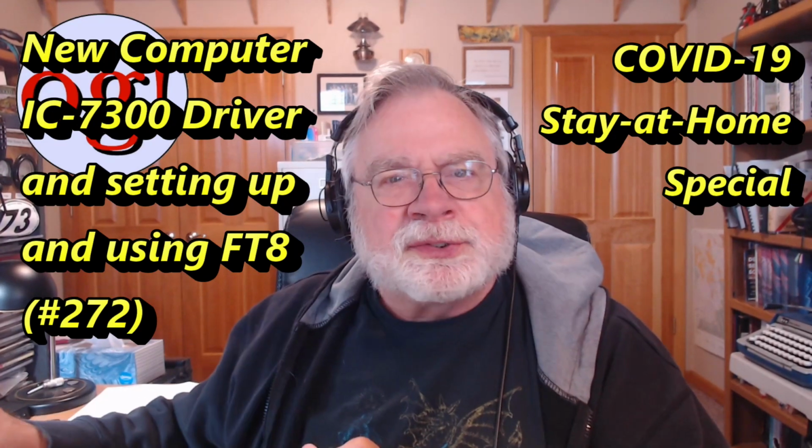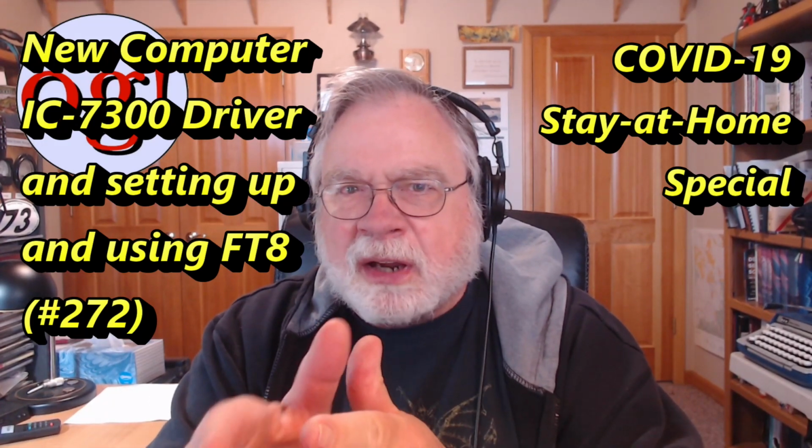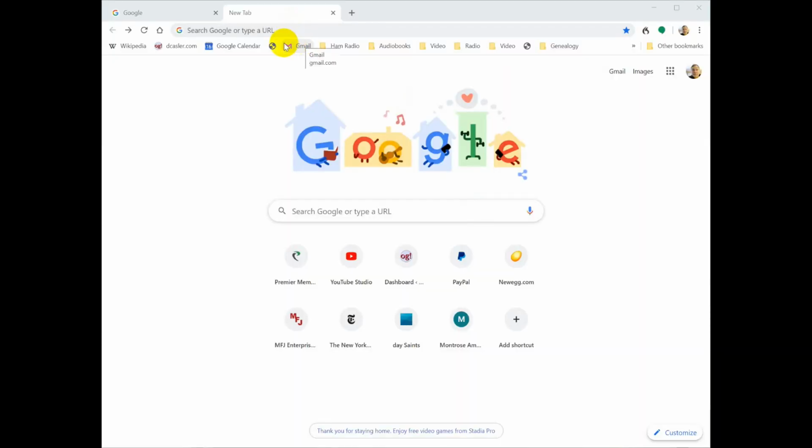Setting up the radios so we get the audio that just not quite makes the ALC do anything. We want clean audio. And then we'll have a couple FT8 contacts and see how that goes. We'll finish by downloading the instruction manual for FT8. So let's jump in. For you detail lovers who want to see every last step of how this is done, this is your video.